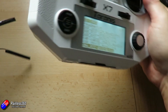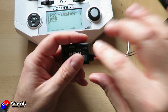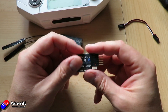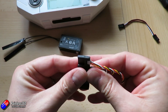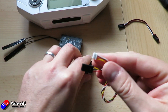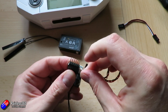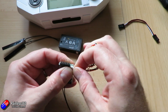It is now done, so I can unplug the receiver from the back of the radio, exit out, and now that should be running the international version of the firmware. The other thing to be aware of is that on some receivers like the X4R, the S port is a slightly different format - use one of the spare cables that you get to make up another cable for those. Once you've got one of each cable, keep them safe because you'll use them again and again.